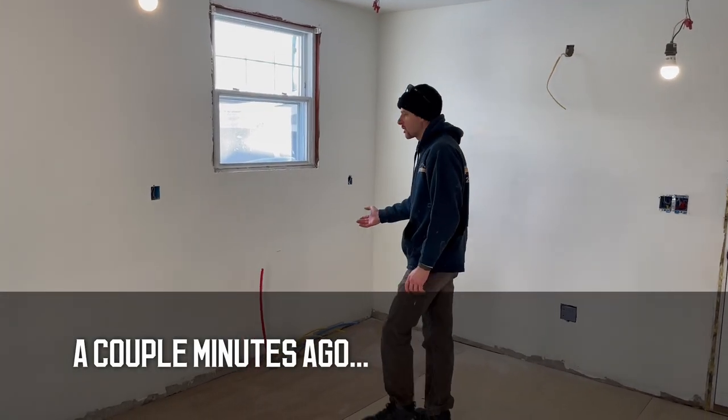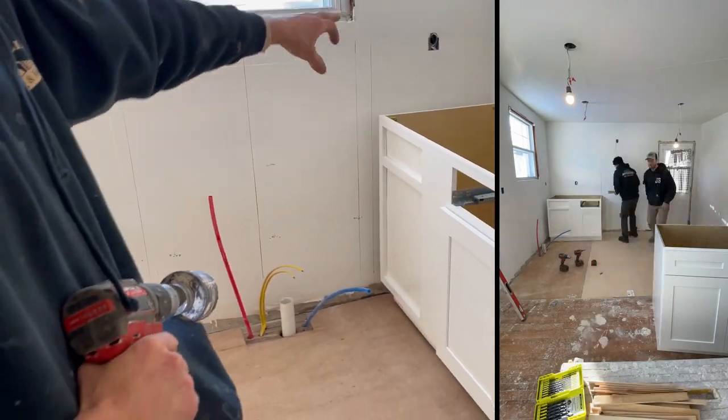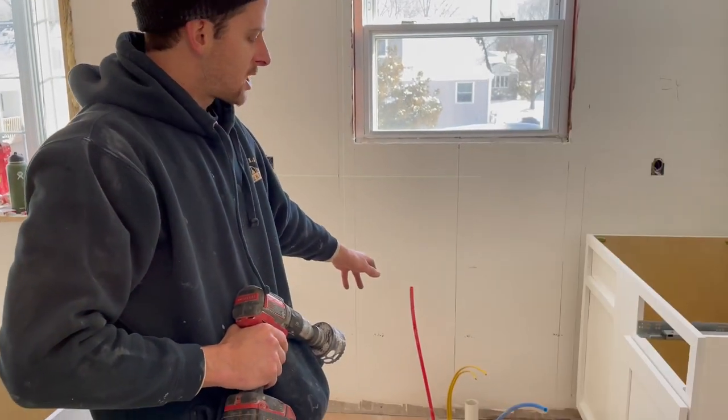I did lie, I wanted to put my blind in first. I'm gonna start with my sink base because I know my sink base has to go completely center. It's easier to work off that corner, which is also the high corner, but it's easier to work off that right in this instance. Now I'm gonna get ready to put my sink base in.